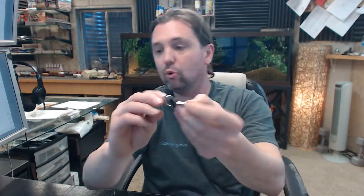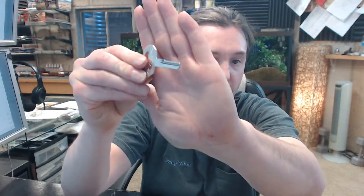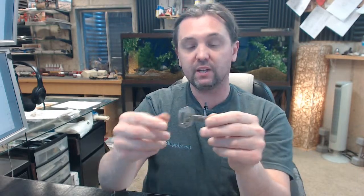There is an image below this video showing the milling profile — it's going to be all but impossible to see on the camera. But that milling profile is exactly what the profile of the blade of the key is, except that it's not looking from the tip, it's looking from the bow, the head of the key down the bow of the key.